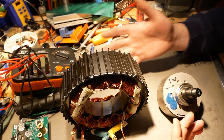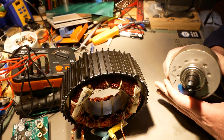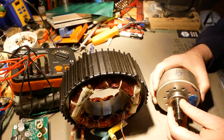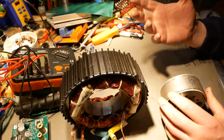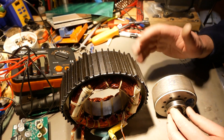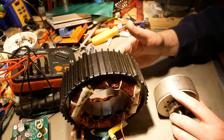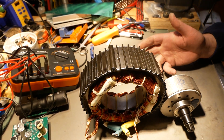If you take it apart you're going to see some of those differences, but the way you'll feel the difference from the outside is you spin this armature and it kind of grabs at the stator teeth a little bit — you'll feel that it's pulsing. Whereas the V1 is just smooth; you don't feel any individual pulsing on the magnets passing by the stator teeth. So just by feel, if it's pulsing there's a really high chance that is a V2, and if you feel no slight resistance as magnets and stator teeth match up, that's probably a V1.